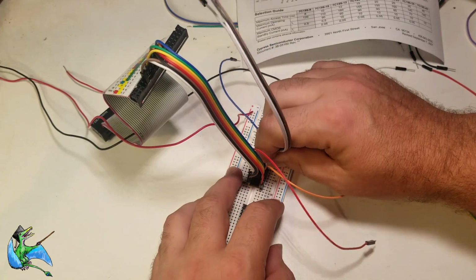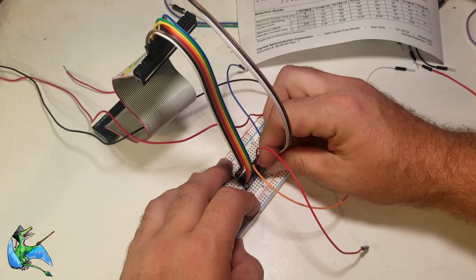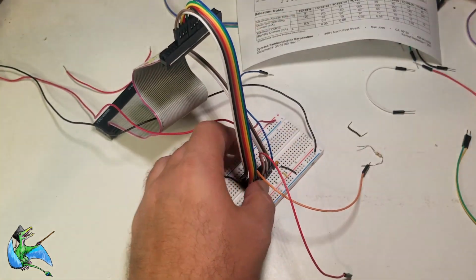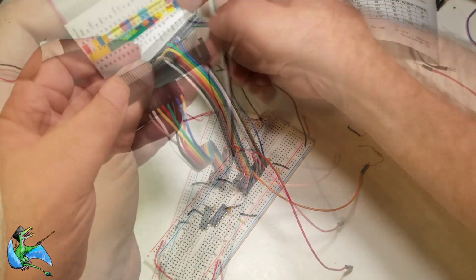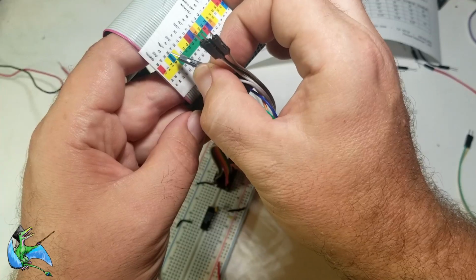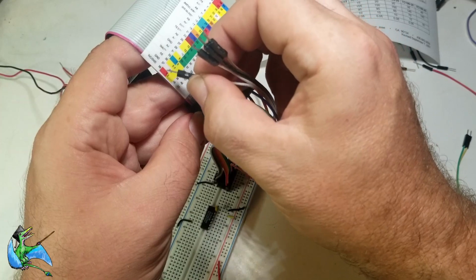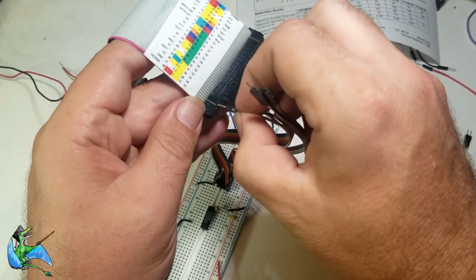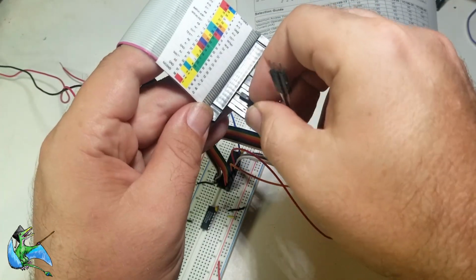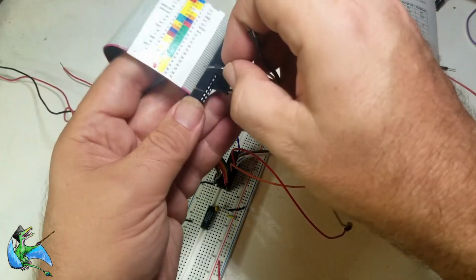This is a 32K RAM chip, so there are 15 address lines in total, numbered A0 through A14, and they're arranged in a counterclockwise half ring around the chip, starting from pin 21, which is on the right side there. Using jumper wires torn off in groups of 4, we'll simply match the signals from the chip to the TRS-80 breakout. The address lines are scattered all over on the TRS-80 end, so it's somewhat picky work, but it goes pretty easily.